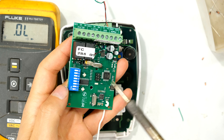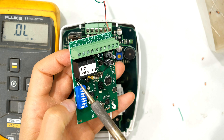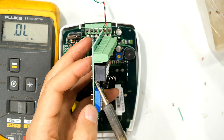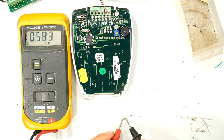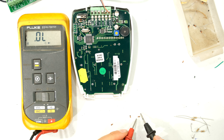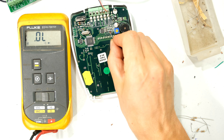I have a faulty receiver board, and I've removed two SMD diodes from it. There are another two over here, so I'll remove those as well. I managed to pull off three diodes from that other board. Testing them: 0.5 volts forward, and reversing the polarity shows open circuit — same with the others. These three diodes are functional, so I'll use these instead of the larger through-hole ones to keep things neater.